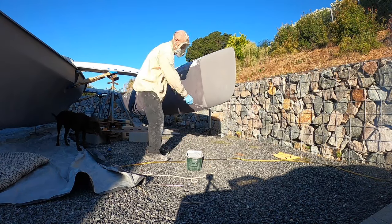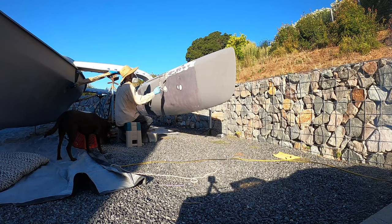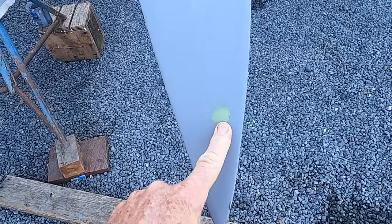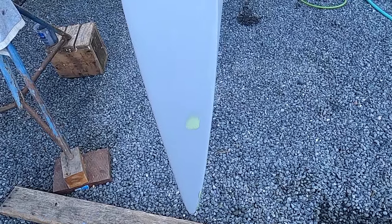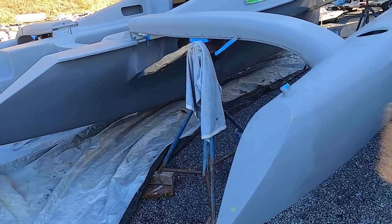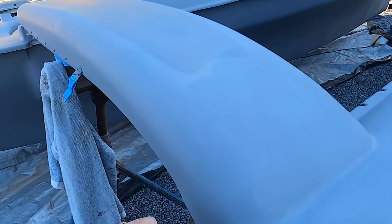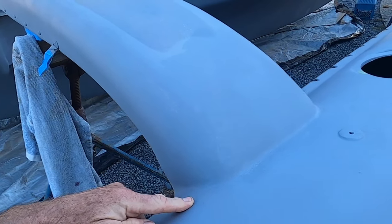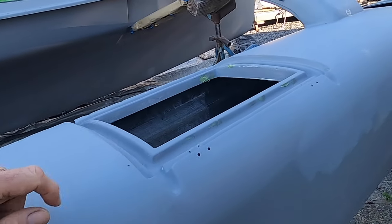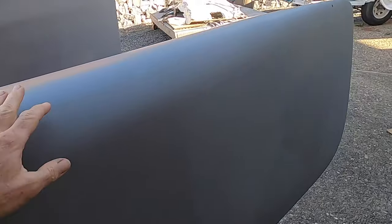After so much surface preparation, it's time to get some primer onto the boat. This was pretty satisfying rolling this stuff on. Progress report on the mind-numbing details of painting: the green stuff is fairing putty, chasing all the pinholes that the gray primer revealed. The whole boat is in primer now. I haven't been filming much of that because who wants to watch me paint? Last night in the evening light, with the sun really low, it really highlights all these little spots. You can see all these little green things — tick tick tick — the front end is all clean.